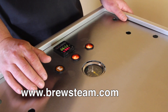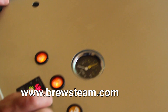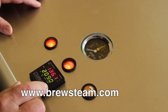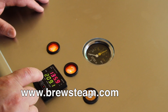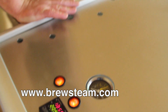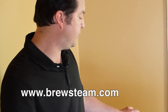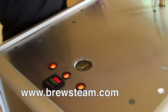So here's how we would actually use the system. We've got 1.1 to 1.5 bar of steam pressure — that's just our boiler steam pressure right now. We've got our target temperature here on the PID controller and our actual temperature here on the PID controller. So if our target temperature is 209, all I have to do is move it up and down very easily to set the temperature. This system does have auto-tune, which is very nice — it uses fuzzy logic and will maintain temperatures within a half a degree. All I simply do is set my actual steam ring, place it in the pot that I want to heat. Then I just press the number three button, which turns on the solenoid valve for the steam. So the first position would be push number three, and number two would be open the valve.